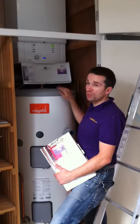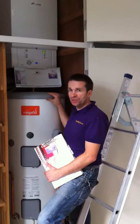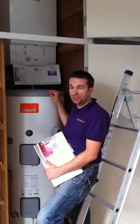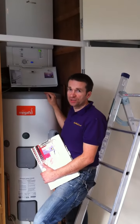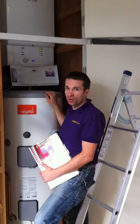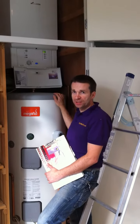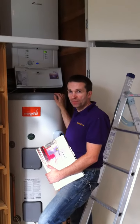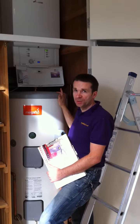At the moment I do a little work for Worcester Bosch and I'm registering the boiler for a seven-year promotional warranty. That's a seven-year warranty on the boiler that covers parts and labour, which is a pretty good deal in today's climate. I also register the boiler with building control and the unvented cylinder so they'll comply with the regulations, and certificates will be sent to the homeowner.